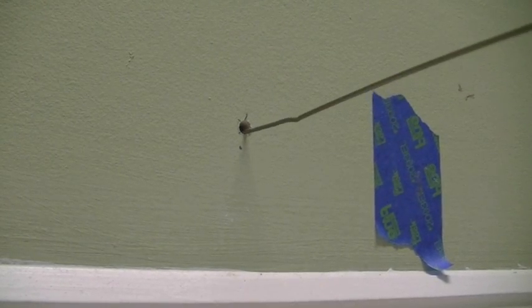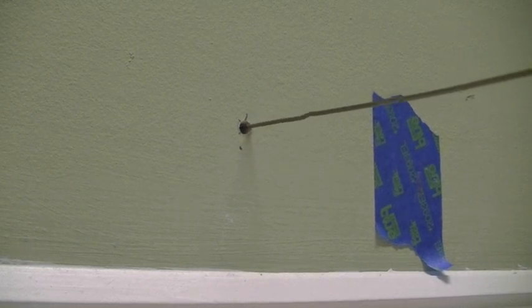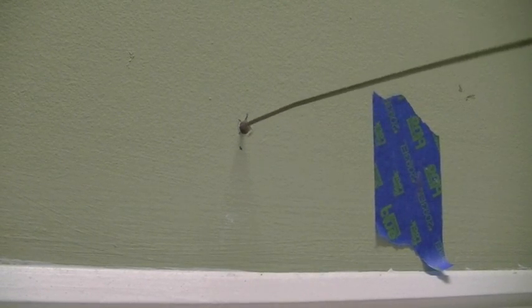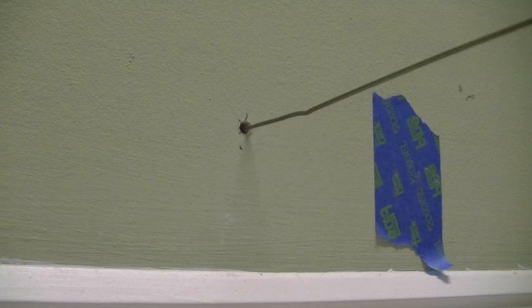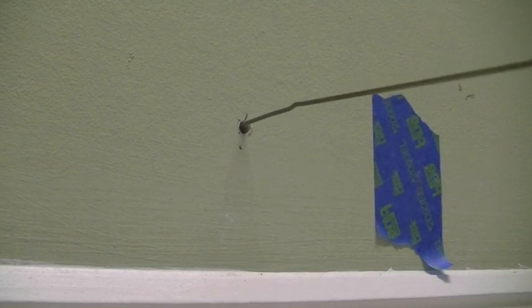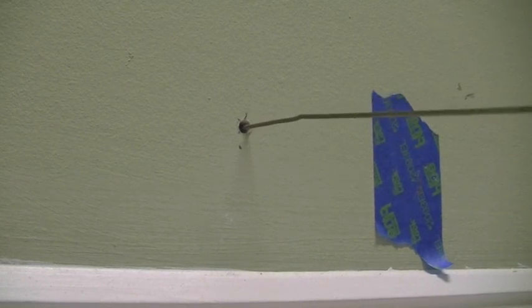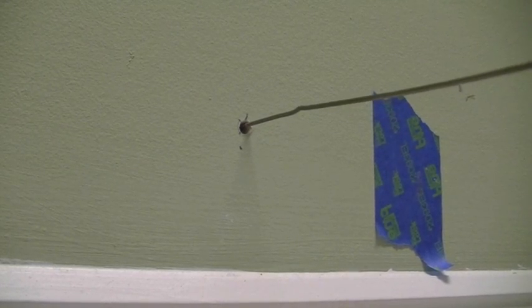Okay, so now I've realized that there's a lot of insulation in there, but I've got my test rod in there and I'm circling it around and around, and I'm not hitting anything. So what I'll probably do now is try to extend that rod out to about 3 inches, so it'll give me a 6-inch diameter to make sure I'm free and clear of anything.